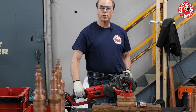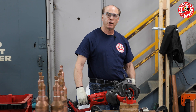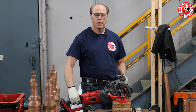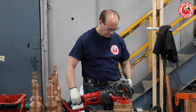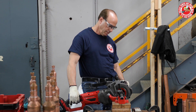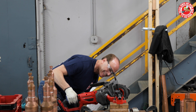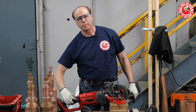How I know when to stop: I want to put it about one usable thread past the outer edge of the heads inside of this tool. That will give me about eight usable threads — and the key is usable threads, in my opinion. I'm just checking how many threads I am past the head. One — that's where I stop. I'm going to hit the button that reverses it.